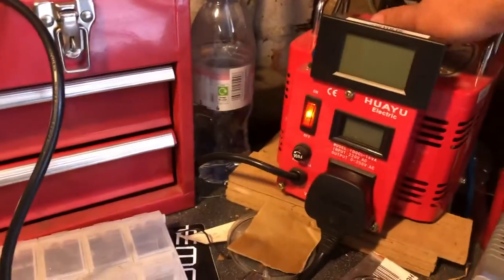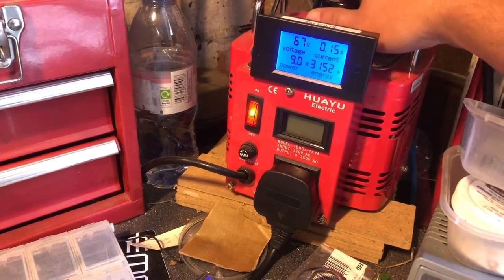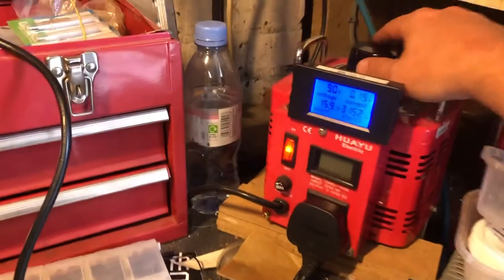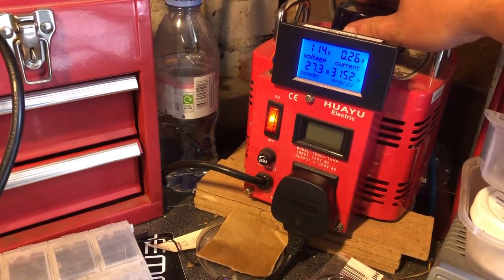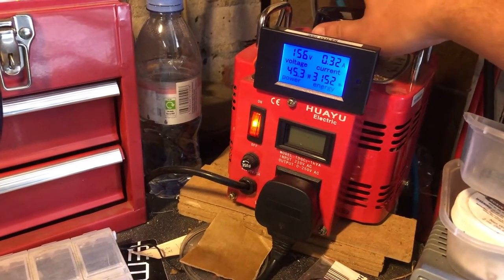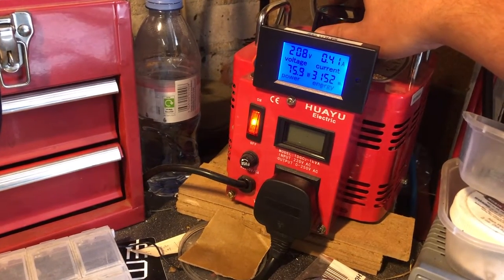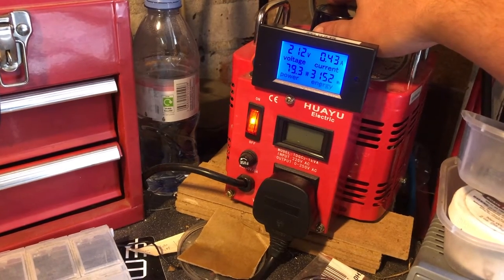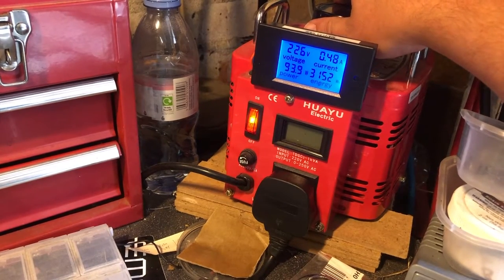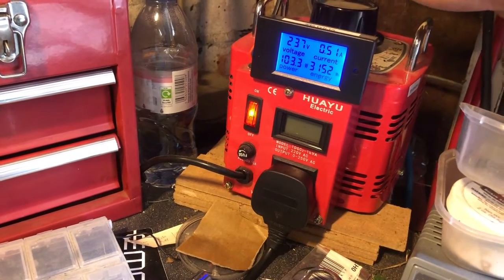Standby on. Reassuring pop. That's cool. Bring it back up. Okay, power lights come on at 90 volts. Relays clicking in. More relays. 0.3. Bring her up to working. Staying below 0.5 of an amp. It's about what we want to see. It's looking healthy. That's close enough.